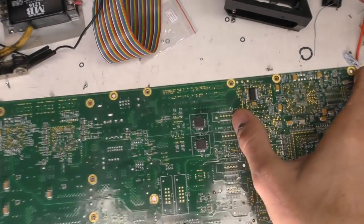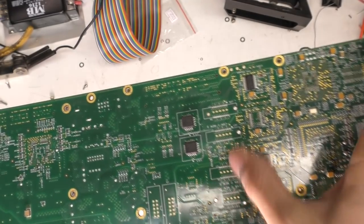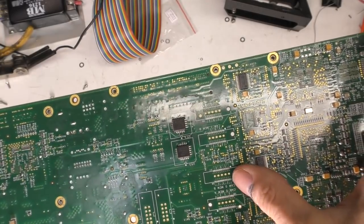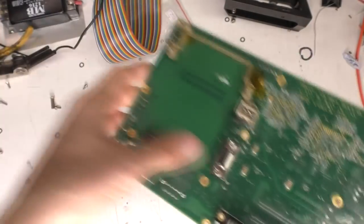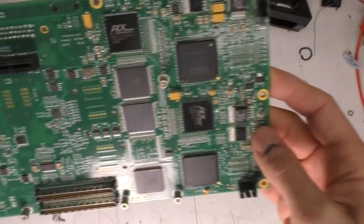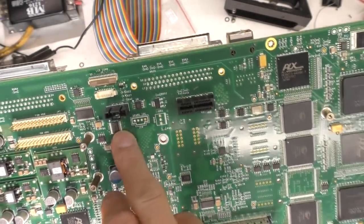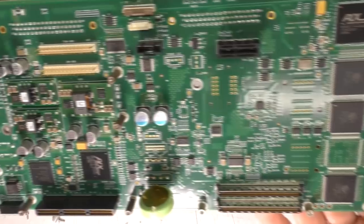There's a load of, I think these are probably debug connectors. These are marked CAM1 mem, CAM0 mem, so I wonder if these are actually debug connectors on the camera memory buses from the FPGA. Various bits of buffering here. This is the area for the rear panel, so you've got USB, VGA and the SATA connector for the hard disk, and the rest is various random bits of support, like there's an I2C bus to parallel port thing there, which presumably controls various status things. There's a little 2-channel temperature monitor. Not a great deal else.